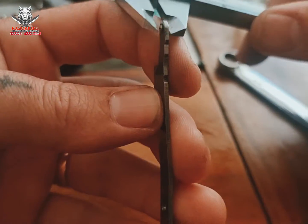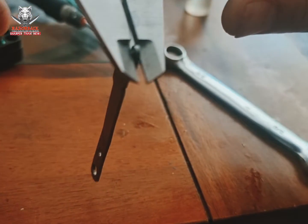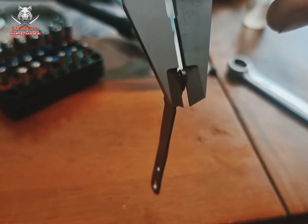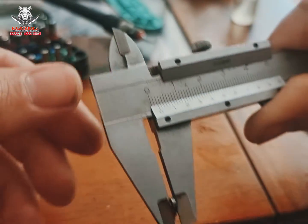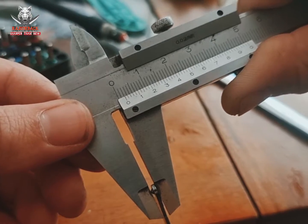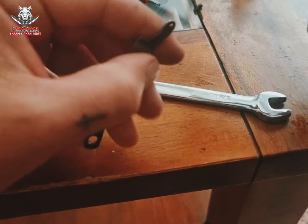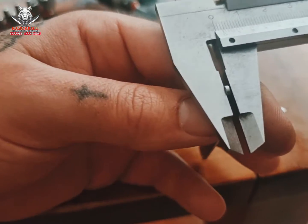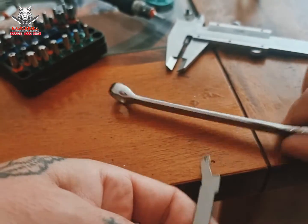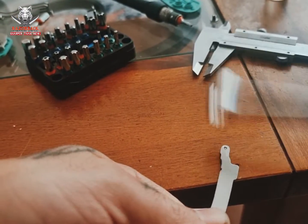Usually I do this in a drill press with a piece of brass, but there's a million different ways to do it. And this detent ball's not a victim. It hasn't caused it any problems. You can just give it a tap with any old thing. They're hardened steel. Unless you go ape shit with it, with something abrasive, I don't think you're going to cause any issues. If it is ceramic though, find a bit of brass to stick in between there and either do it in a drill press, a vise, or even a set of vice grips could probably do it.